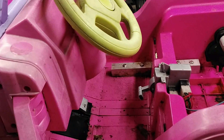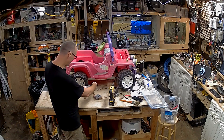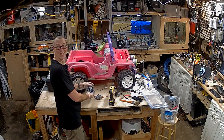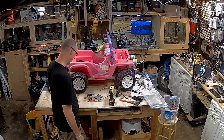The default way Power Wheels works is to send 12 volts to both of its motors, and it's all or nothing — either full-current forward or full-current reverse. The forward and reverse is the most mechanically simple back-and-forth thing I've discovered. It's purely mechanical. There are two switches — single-pole double-throw, technically. That's horrible. I think I need to get rid of that.